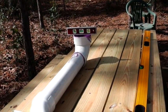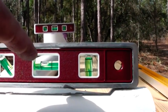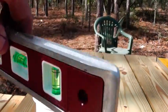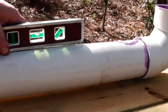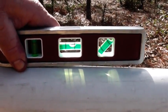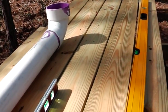I just wanted to show you how I run my drain pipe. Our local codes around here — this is what they want to see. The pipe should drain that way, and you want to have that bubble just a little bit to the side opposite of the direction it's draining. I want this level. I put the pipe in the ground and pack it in. I've seen plumbers come out and use levels and transits — it comes out to about an eighth of an inch every foot, or an eighth-inch drop per foot.